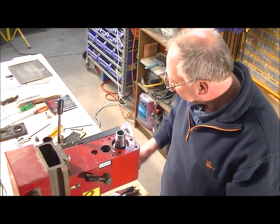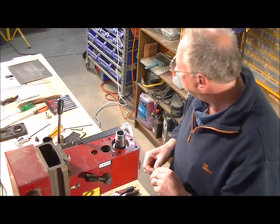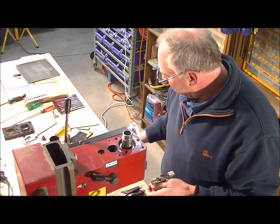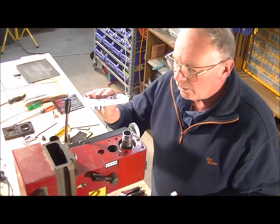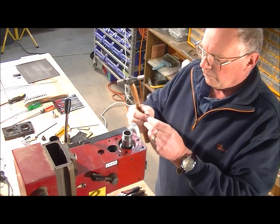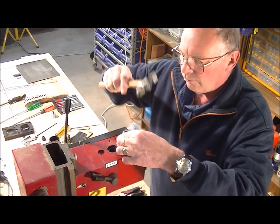Now we're at the stage where we can put all this together. I've cleaned the key up and we'll put it back in — it's easier to get the keyway back in before I put the plate on. This is 9mm thick and the production unit is going to be 12mm. Just put the key in the bottom with a very gentle tap, that's all it needs. I just want to trial fit this on — yeah, that's fine, perfect actually.